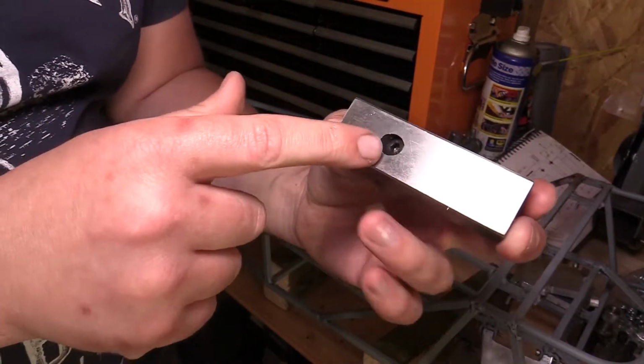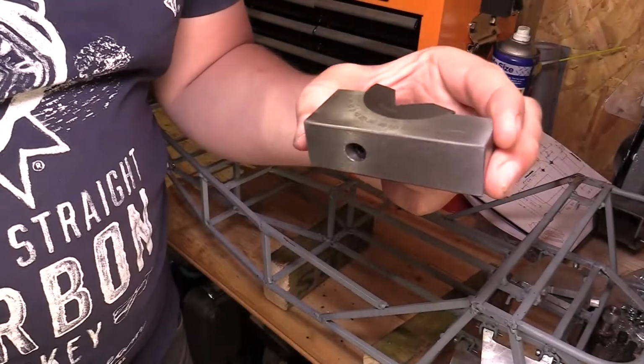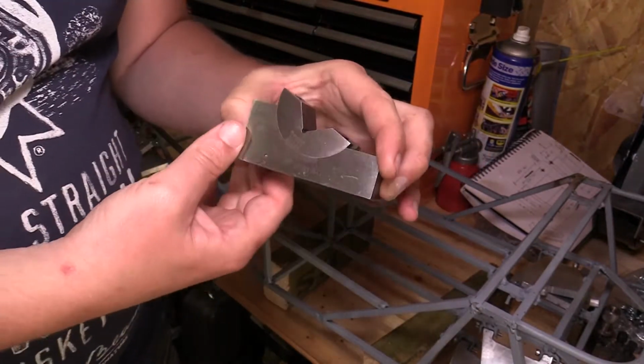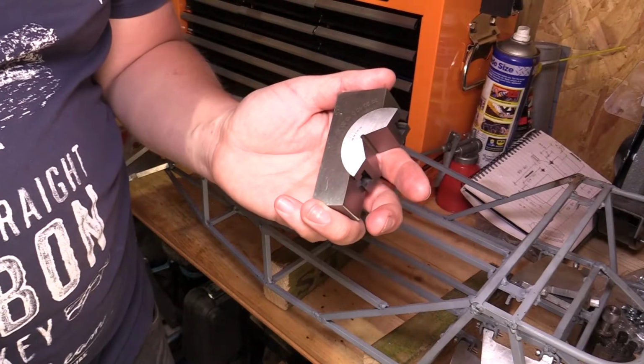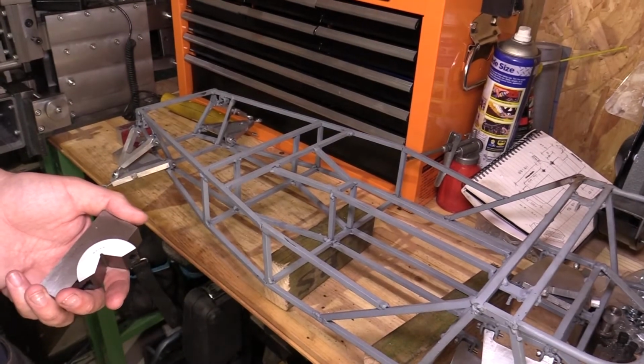And all you do is lock that angle once you've got it in position with that cap head screw, that Allen screw under there. So I'll get these parts set up. First of all we need to recess that front face 2.2mm, then we'll get this in the machine vise and we'll cut that angle.